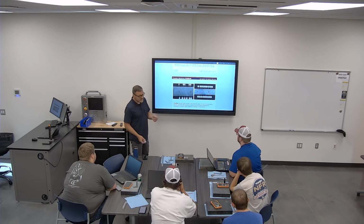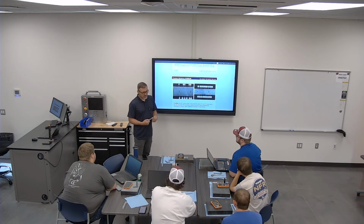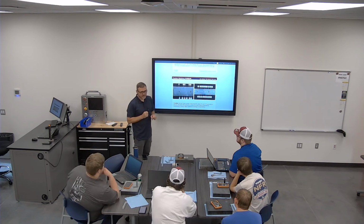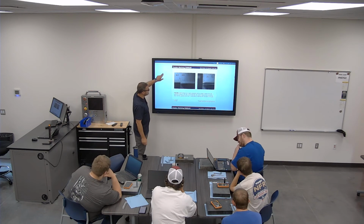All scales, since they're oftentimes stamped, have a tendency to break at the inch increments. If they break at the 1-inch increment of the scale, then it needs to be replaced. But I would keep those pieces. Like, I have some 1-inch scales, so if I have to get down into some really small areas, I'm like, cool, got it. So keep your broken scale. It ends up being one of these.